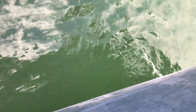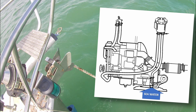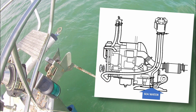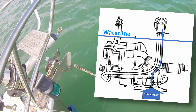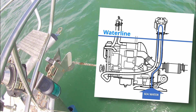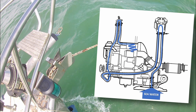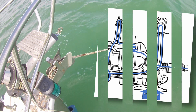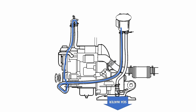Suffice to say, I've fitted exhaust alarms on all boats I own and it's been a very good investment. With the alarm sounding, a quick check over the side confirms there's no cooling water coming out of the exhaust, so the problem is definitely with the raw water cooling system. In a raw water cooled engine, water enters through a hole in the bottom of the boat — or in this case through vents in the sail drive leg. The raw water pipes are protected by a seacock, and the first length of pipe rises above the waterline into a large strainer. The water then flows down to the raw water impeller pump, then up to an anti-siphon valve and down into the heat exchanger, exhaust elbow, and out over the side. We start fault finding by removing the lid of the water strainer. If there's no blockage between the strainer and the seawater inlet, water should drain out as soon as the lid is untightened. No blockage found.